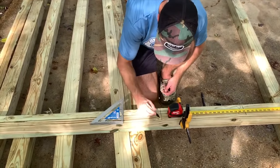At this point, take a utility knife and cut off any excess flashing tape that extends out further than the trim. Just run it along the perimeter of the trim with the utility knife, and then you'll be able to peel it away. After removing any excess flashing tape on the sides of the window, I moved on to the top and cut off the excess flashing tape by running the utility knife along the window trim and then simply peeling it off. We're gonna perform touch-up paint later, so if some paint comes off, it's not a huge deal.